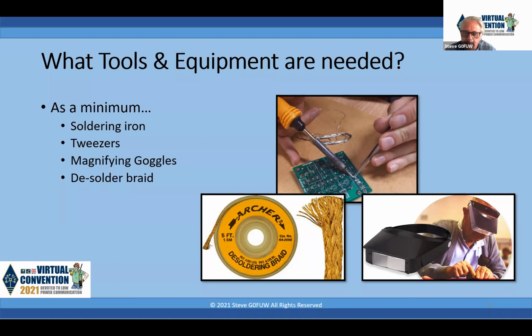And certainly in the early days, people were advocating all sorts of weird clamps, and there's quite a number in Sprat actually, like a sort of nodding donkey, a miniature oil rig type thing that would hold the component down whilst you soldered it. Well, I don't know who it was that discovered that if you solder one end first and then do the other end separately, you don't need to hold them in place. You just use the tweezers, which you've got far more control then. So yeah, it's definitely doable just with a soldering iron and some tweezers. And I'd certainly recommend, if you're going to give it a go for the first time, that's probably the best way to do it, and give it a try.